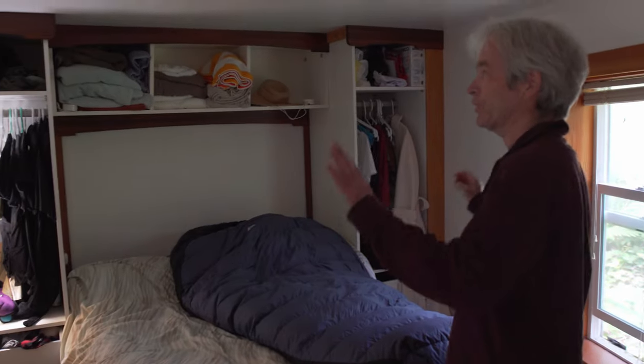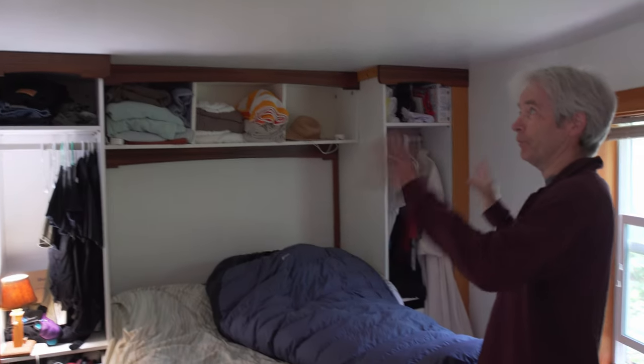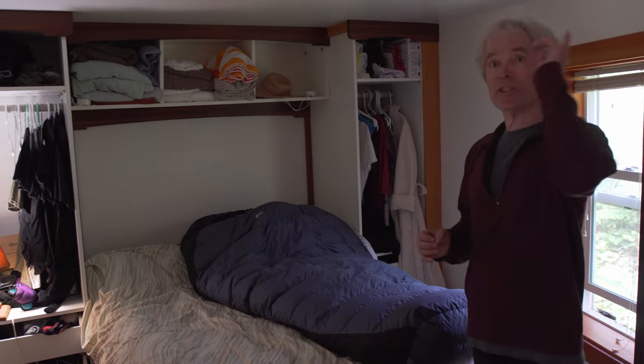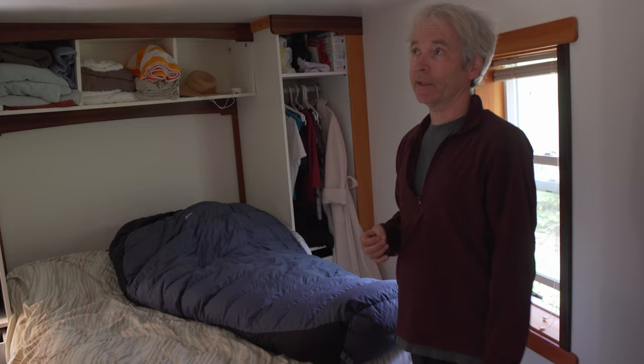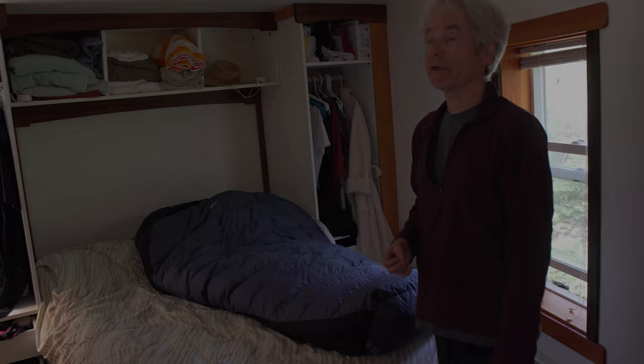It's self-contained, and we've soundproofed this. We've got two by four and then two by six on the roof with rock wool soundproof insulation. We ran resilient channeling — metal stripping — all the way around, and then hung the drywall off that. It makes for very effective soundproofing because the bathroom is right next door and the yurt can get quite loud with rain and wind. It's nice to be able to close the door and have it feel more like a conventional house.